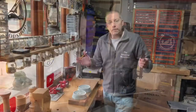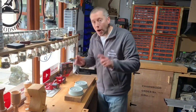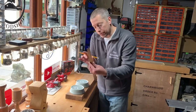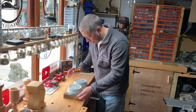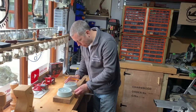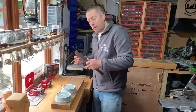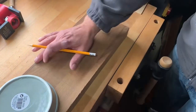Okay, folks, we just want to do a few measurements first. The easiest way to do this is set the wood down, turn the bowls over. Now, obviously, you're not going to cut out that bit of the wood because, of course, it will fall through. But what we want to do is just know where our gaps in between are. So using a standard ruler, I'm using the thickness of the ruler. So put the ruler there, and that'll set up your wee bowl to there. Again, put the ruler in between the bowls and bring that bowl to there. And then do it again on this side here. And then we'll draw a line. And what that allows us to do, if the cameraman could come in, we'll be able to let you see here that that's the line there. So now we know that they're perfectly spread apart once we cut that line.